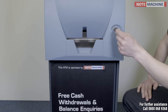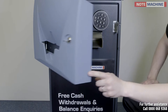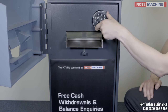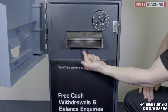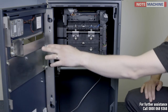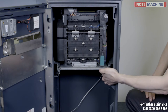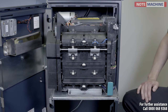Use the key to open the fascia door. Enter your password, turn the dial and lift the hatch to open the safe. Once open, you'll be looking at the dispenser. Push up the small catch on the bottom right side and pull the dispenser towards you. You now need to pull the dispenser around to get to the cassettes.